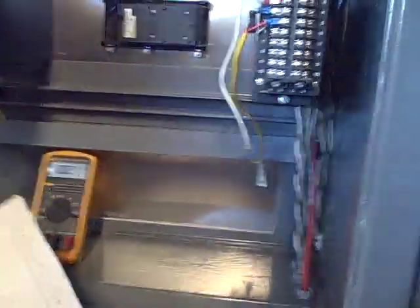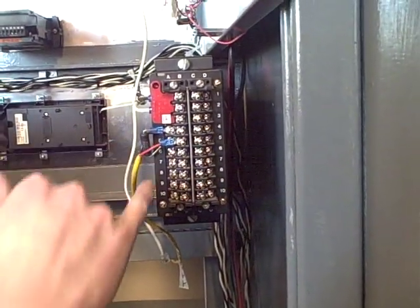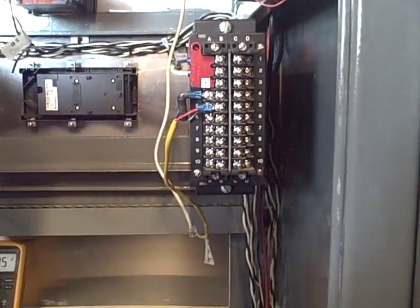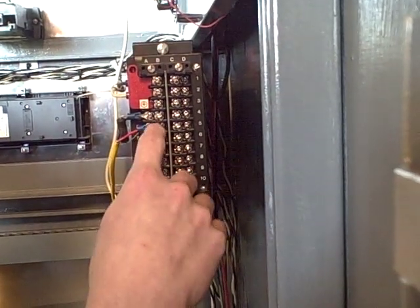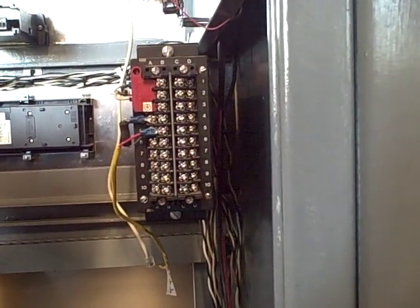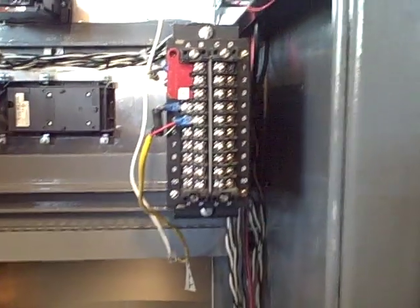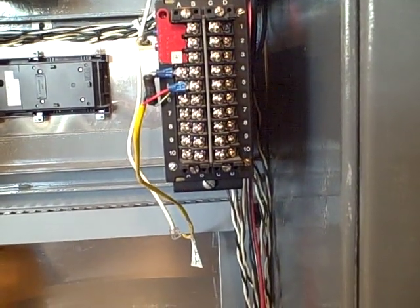I need a verdict in about 15 seconds. Where do you think in the system the problem is and the nature of the problem? I'm pretty sure it's going to be a wiring issue right here. Red to B5, black to A4 — that's fine. Resistor A4 to A5 — that all seems fine, so I'm thinking it's something in the controller programming.